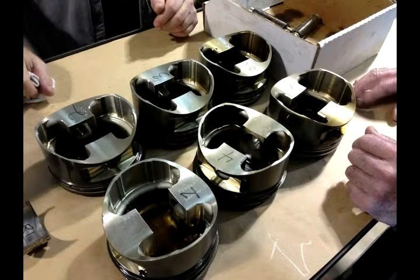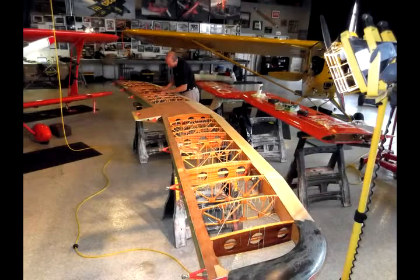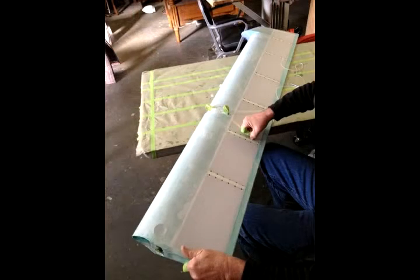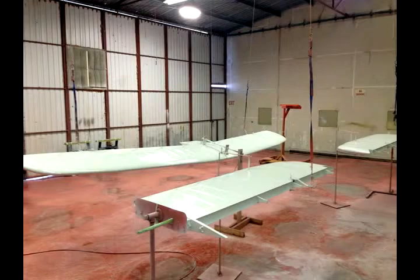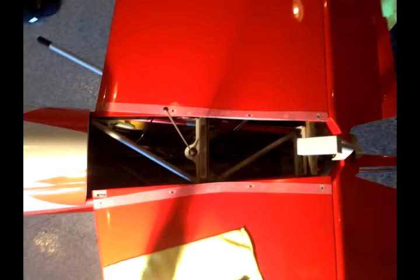While that's taking place, the wings have been removed from the aircraft. The ailerons are removed from the wings, the elevator, the rudder — all sent down to our flight school in King City, California. The structure is inspected, and the fabric will be reapplied. It's actually hand sewn onto the airplane using about 1,500 stitches. The fuselage is thoroughly inspected, and every single piece of hardware gets replaced — every nut, bolt, washer, screw, and bearing.